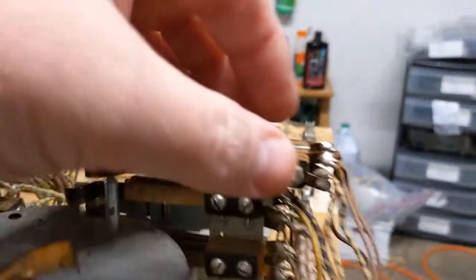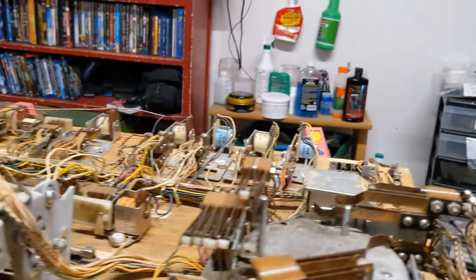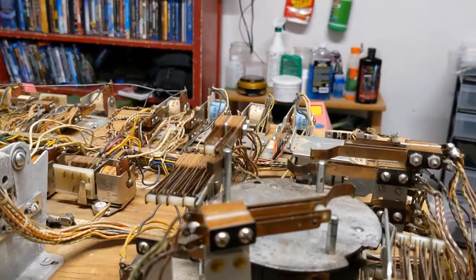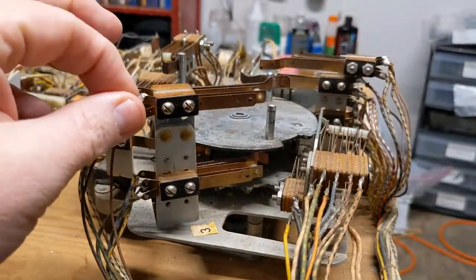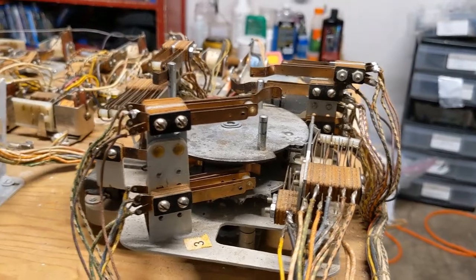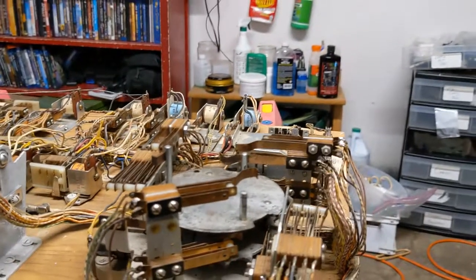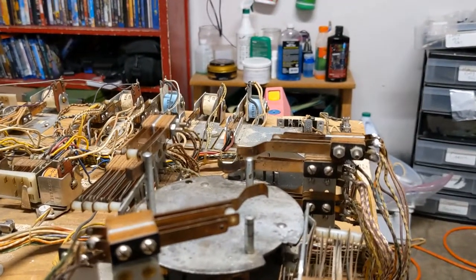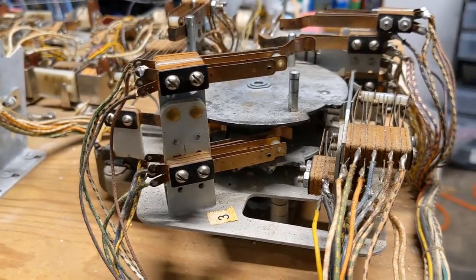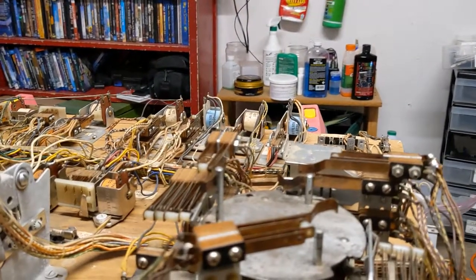So what I ended up doing was I have reflowed this one, and I have gotten it back on. And I went through the entire game again, not just here on the relay board, but in the back box as well. And I tugged the lug on every one of them. I pull, a good, decent pull on it. 18 points came loose throughout the board and the back. That just means that they might have been making connection because the game was working, but they were getting ready to come loose. So I went through all of those points and I reflowed them and I checked everything again, and reflowed anything that was even suspicious.